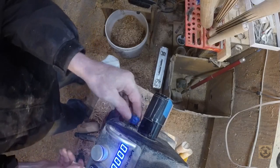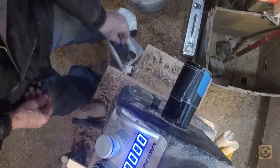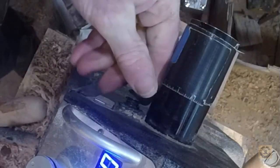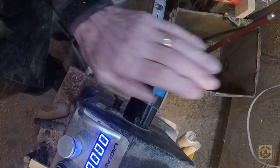One of the few things I dislike about this lathe is this indexing knob should be back here — it's here. Guess what your thumb bangs onto and scuffs up all the time. Now for the first almost year I just took this out and put it somewhere else, but I use it a lot now to lock the spindle for spot sanding inside. Still, I've got this problem even with the tape on there. So I thought this morning, why not put a big wheel on here so that my thumb doesn't come anywhere near that.